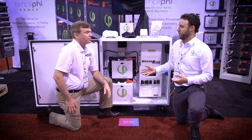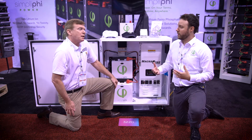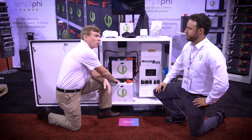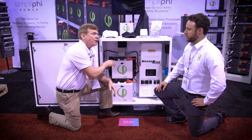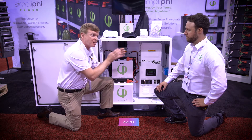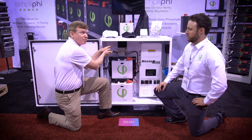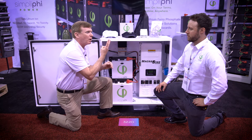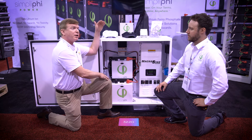So the Tristar — I see 45 amps — can you tell us a little bit about how much PV we can run through the unit and what its capabilities are? On a 45-amp system, it depends of course on battery voltage. It will operate with 12, 24, and 48-volt battery systems, and as you have higher voltage, you have less current to supply the same amount of power. So with higher voltage you can have a higher amount of PV in the system. On a 45-amp controller, you might think about roughly 2 kilowatts of PV. With a 12-volt system you'd have less PV, and with a 48-volt system, more PV.